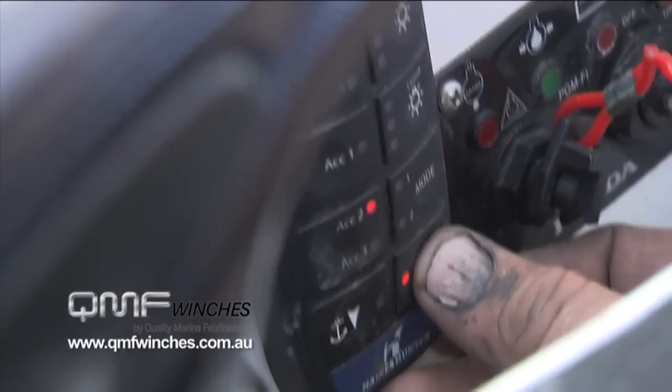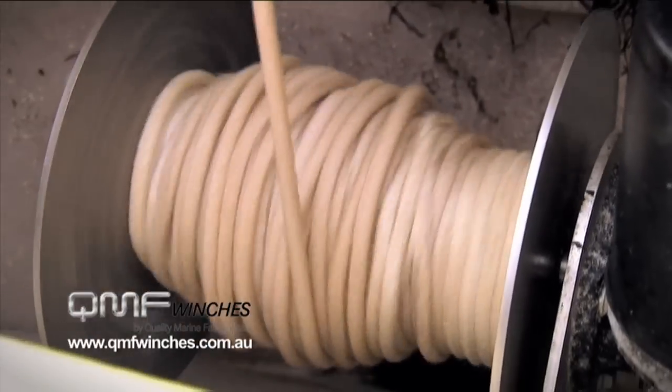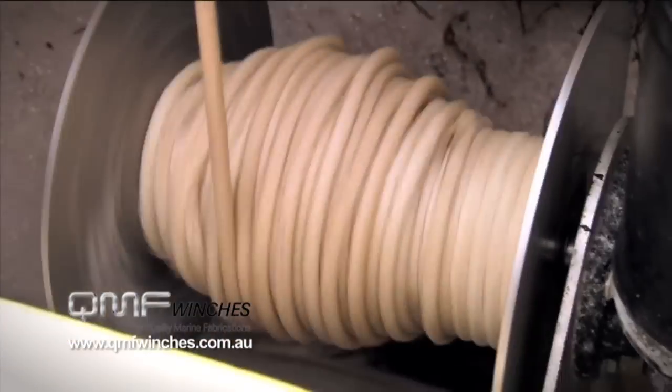Are there any tips you can give people who've got one of your anchor winches fitted to their boat? Obviously they should operate the anchor with the engine on so you're not draining your batteries. Yes, that's correct. The main thing is when you're putting it down, as you're going down you've got to watch the rope. When the rope goes slack, you take your finger off the button, you put the boat in reverse, and you just let out rope as you think you need it. Bigger day, bigger waves, you obviously let more out. Today was just like glass, so you hit the bottom and that's it.